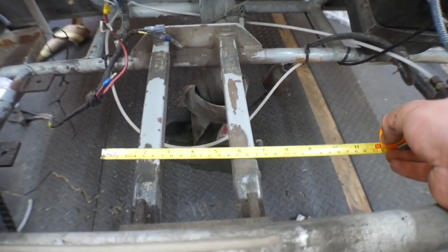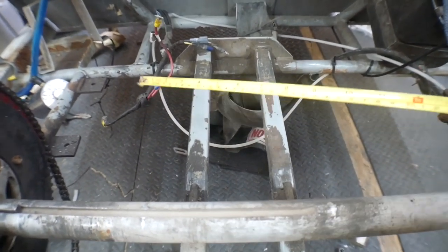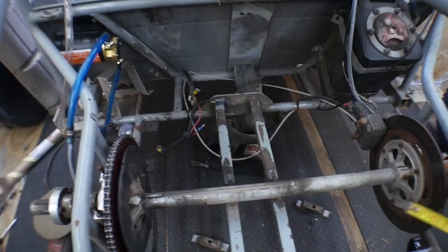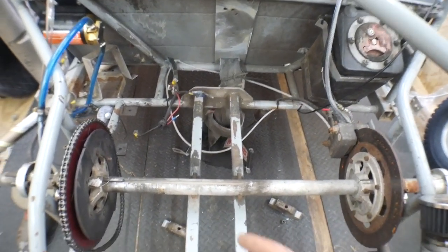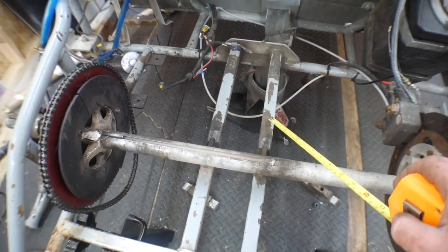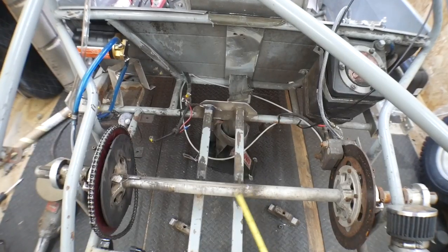I need this to be seven and a half inches, so half of that — 3.75 inches — needs to be right in the middle of these two bars. To ensure the two main engine mounts are straight, I'm going to cut some flat bar to seven and a half inches, weld it on here quickly, and use it as a reference. I have plenty of flat bar so I won't run out. I just need to grind off the dirt and paint, then cut it with the new cutoff wheel.